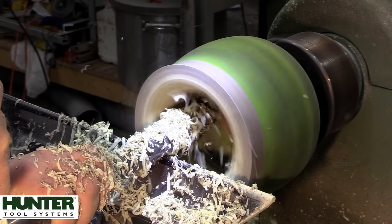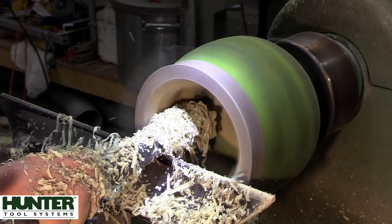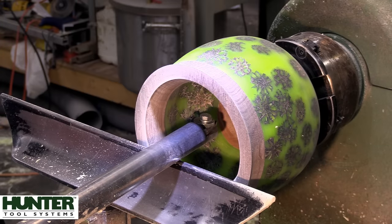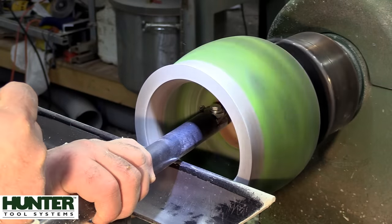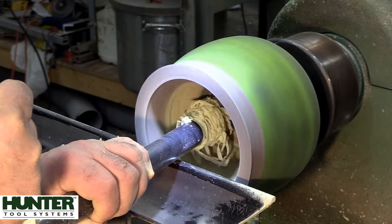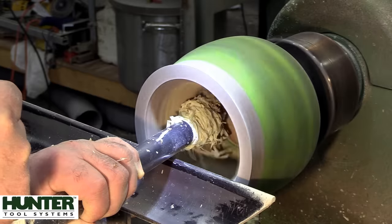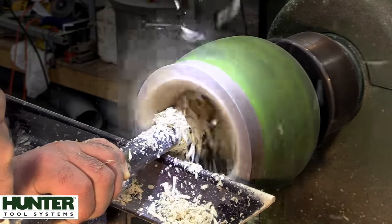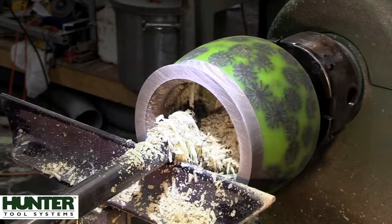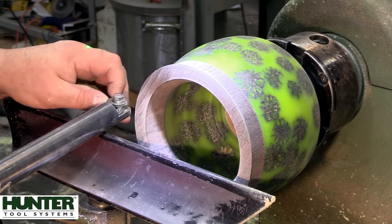So what I would really like to see, and I'll talk to Mike on this and see if it's even doable or not, is a large washer with a slot cut in it to hold that cutter, and then of course a through hole where you can just clamp it down onto the boring bar. That would be ideal, I would think, and that should keep it from moving around. Of course, it'd have to be a little bit not as tall as the bar on the cutter itself.